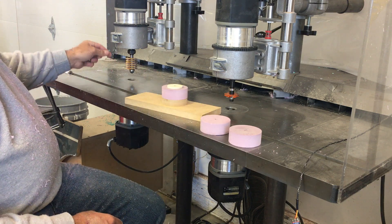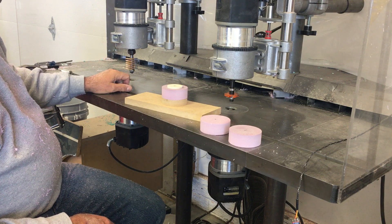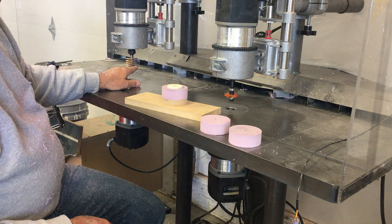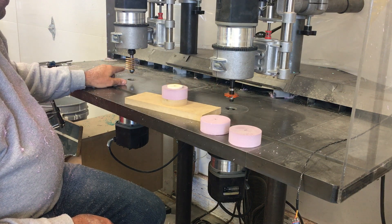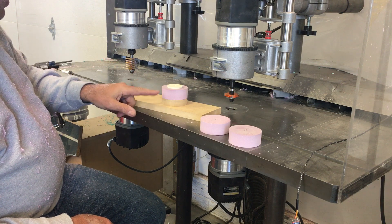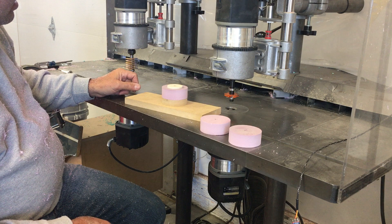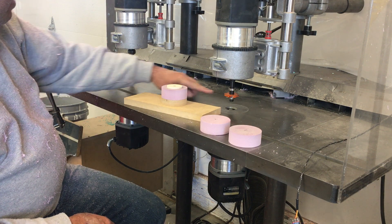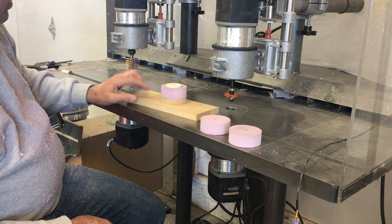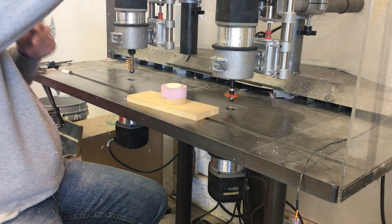These operations here — I've got a stack finger bit that cuts all the fins, they can cut about a half inch deep. Then this is just a wing cutter because I need to clear out some of the area at the bottom so it fits down into the cylinder head. They're all guided by bearings, so pretty simple operations. Let's have at it.